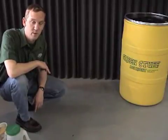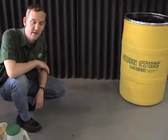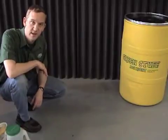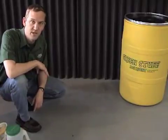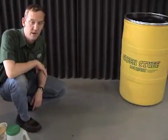Many people try and clean up liquid polymer spills by using Speedy Dry or Kitty Litter, sometimes referred to as clay or Georgia Fuller's Earth. It's a common material, relatively cheap, and it's been around for a while, but it's not very efficient at all at cleaning up polymer spills.